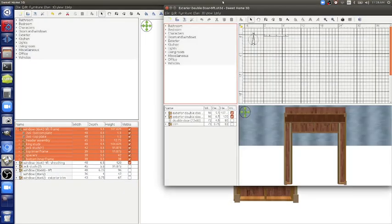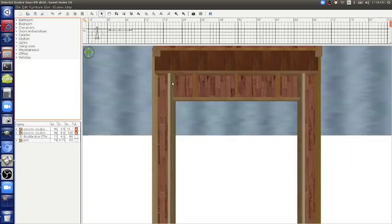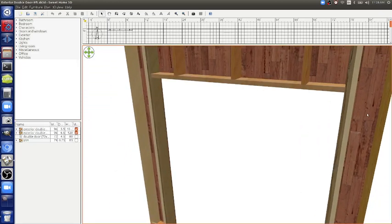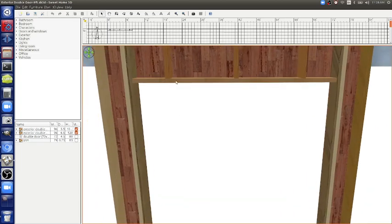So what do we have for that detail? I am seeing one. Wall 167? Yeah. There's one there, and there's two. And there's two. Yeah. Altogether, you have three vertical studs supporting each side. That's structurally a spine. The header here is actually triple. You need that for the 8 foot span. That's three 2x12s? Yep. So around the door frame, there's two of the 2x6s, and on the edge there's one. And it's somewhat visible.